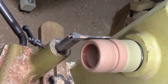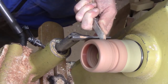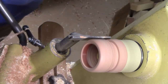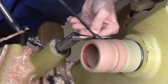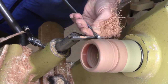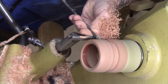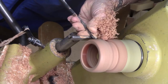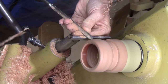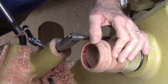I'm going to use that parting tool to get it flat, back off just a little bit. I don't want to worry about making it thinner where the handle is going to be — I just want to pick up the curve a little bit here. We're going to start it here and come back a little bit. Now we've got more of an appearance of it being round.